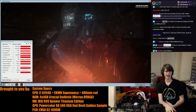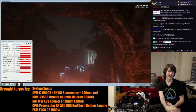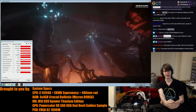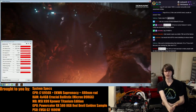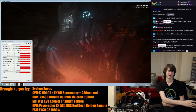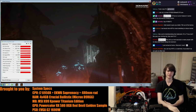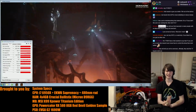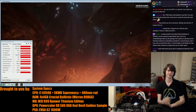Actually, I don't know what NVIDIA's official stance is on overclocking, but in terms of what NVIDIA does, they are actively trying to block it. Very legitimately trying to block overclocking. They do everything in their power to make it as hard as possible to overclock their own GPUs. They even tried to completely lock down laptop GPU overclocking. Whereas Intel might say you shouldn't overclock their K-SKUs, and then they still make K-SKUs with all of the voltages and settings available. As long as you buy a motherboard that goes to 2 volts, you can shove 2 volts into it, and nobody is going to stop you. Whereas the board partners for NVIDIA literally can't get unlocked BIOSes approved, because NVIDIA is just like, nah, nobody can change voltage on our cards. No.